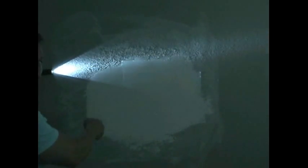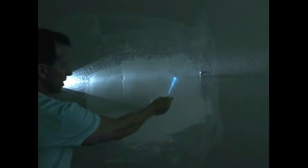When the lights are all on it looks fine and it feels smooth. I feel slight ridges right here, but if you're not knowing what to feel for you may miss it. This way you won't miss it. I'll use a flashlight, or if I'm doing a whole wall I'm going to use a work light. But this flashlight is going to show me every little imperfection — you see this right here and this right here. Those are imperfections that we want to get out when we go to finish floating this. We don't want to put texture on there and have these little spots showing up.